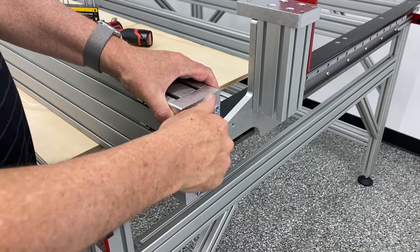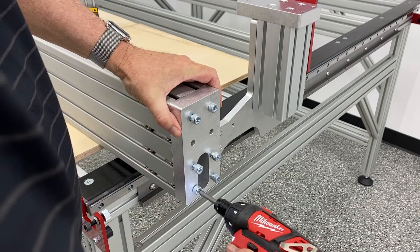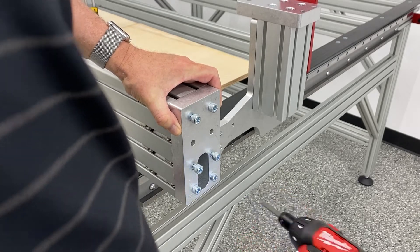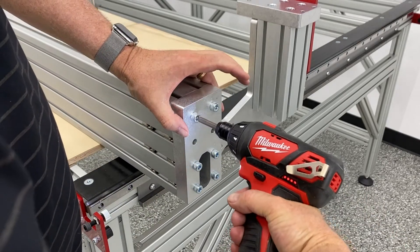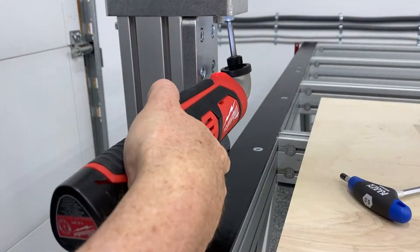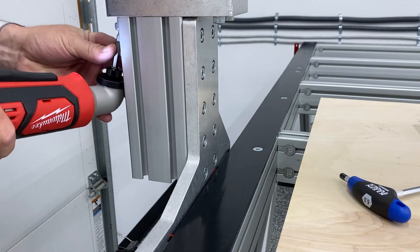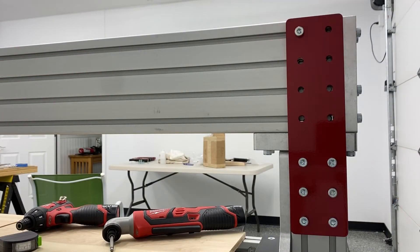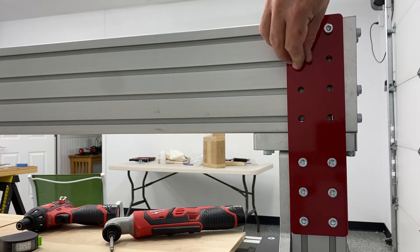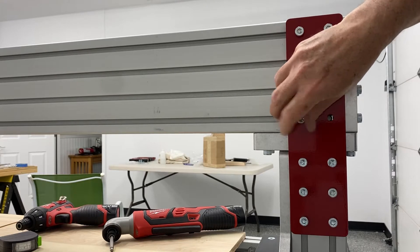The next step in the assembly process is placing an end cap on the left side of the gantry. You're looking at the left side from the back here, and I end up going off camera to put it onto the machine itself. Just make sure this end plate is oriented correctly — there are two holes on the bottom which are slightly offset from center, and it's critical you pay attention to that, otherwise you won't be able to screw the gantry onto the riser plate. Then go ahead and secure your gantry on the left side and back, putting your bolts into the T-nuts already in position behind the red plate, and tighten it down.